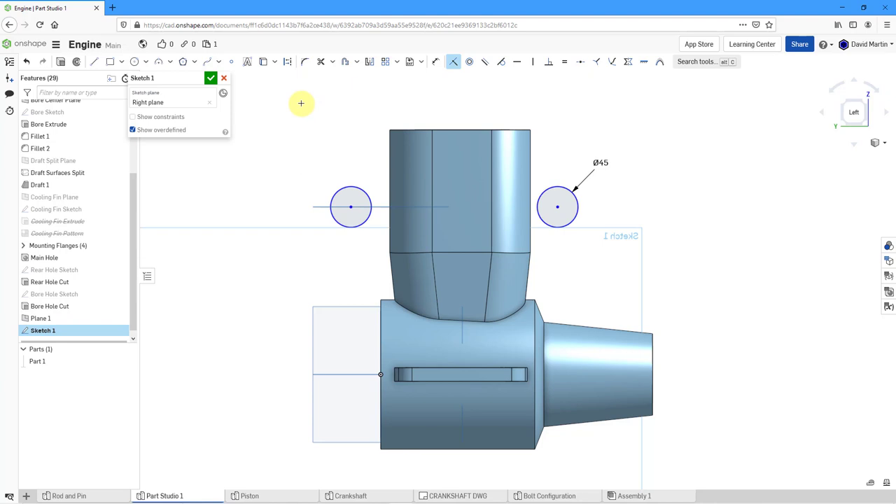I need a dimension from this plane, so let's put those in. They are actually going to be different from each other — this dimension is going to be 100, and this one is going to be 105. Let's create some horizontal lines to connect them. The lines are in blue, and I can tell I don't have them tangent yet, so let's put in some tangency constraints.